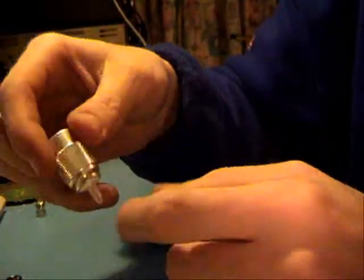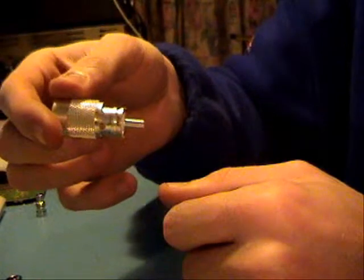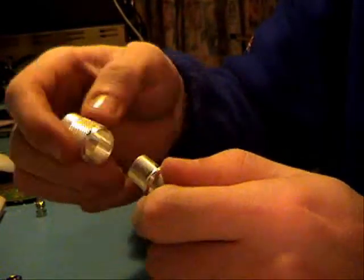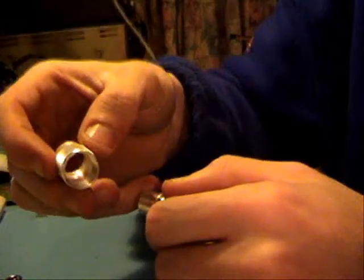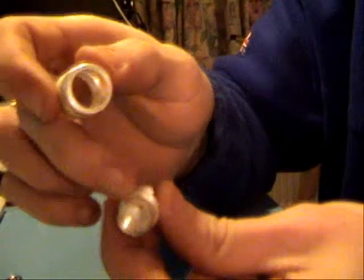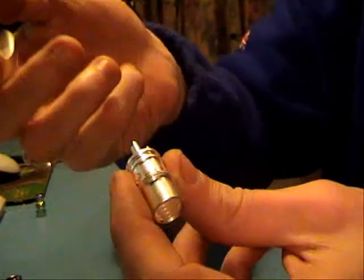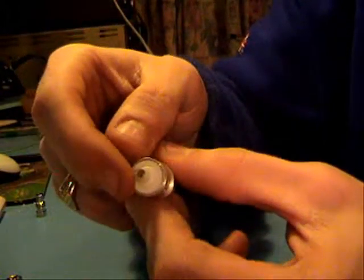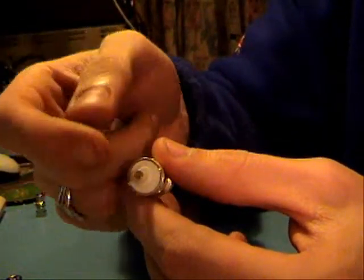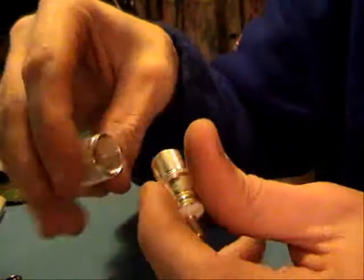This one here is the most common type that you'll see for amateur radio — it's called the PL259 or the M-type. That just comes off; that's the bit that actually screws onto your radio. It's got a recess in there where that can pull freely but then it stops against the side wall and pulls it up into the radio so it can't go anywhere. The shield connects to the inside of here and then the inner of the coax is soldered to that point there, then just cut the rest off and you've got your connector.